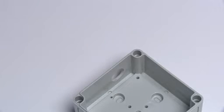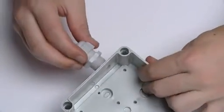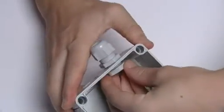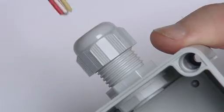In situations where you need the highest levels of ingress protection and cable retention, a clamped dome top cable gland is an ideal solution. However, they do take longer to install. The cable gland is secured with a locking nut and the cable is fed through. A sealing ring inside the gland clamps the cable and forms a high IP seal when the dome top is screwed down.